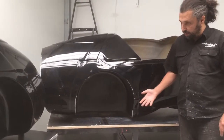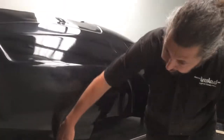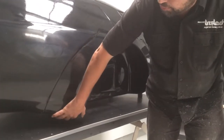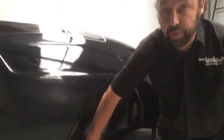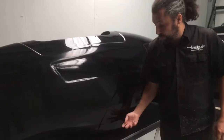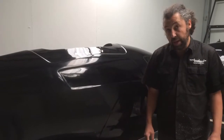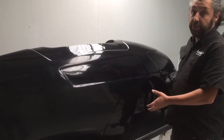The obvious change in the Aquila 3 pattern is that the nose cone bond goes much further back now. That means we get both the cell and the nose cone and the glue which is holding the two together all in this region — lots of material. This means that when the shell gets older or after a couple of seasons, hopefully most of the damage sustained from crashes is going to be all in the nose cone, which is the replaceable element.